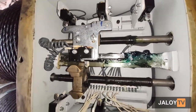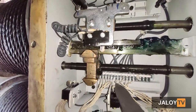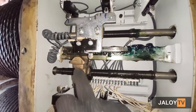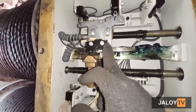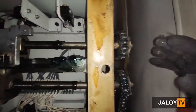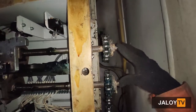Micro switches, etc. The screw shafts are so arranged that they are interlocked with the drums of the hoisting and luffing winches and cause the travel pieces to move with drum turning. Thus the micro switches are actuated and cause the electric motor of the hydraulic pump to be stopped. The motor stop causes each mechanical brake of these winches to apply.